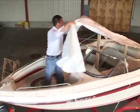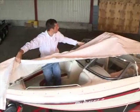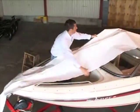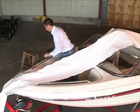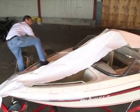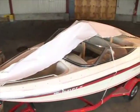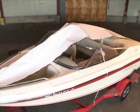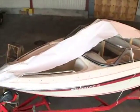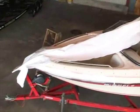So we want to have it all folded up, and again that's another good reason to have the perimeter band tight. Because now when we have the film on and we unfold it, the first time we want to be able to tuck it and have the perimeter band actually hold the material underneath it. Now as we're putting the film on, we want to have an extra six inches at the bow below the perimeter band and the same thing at the stern.